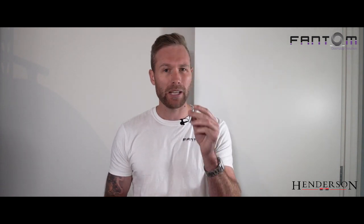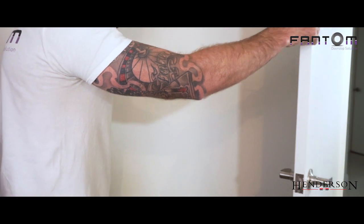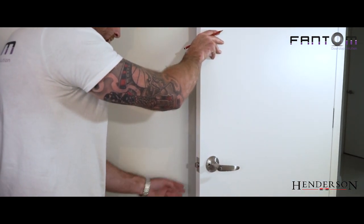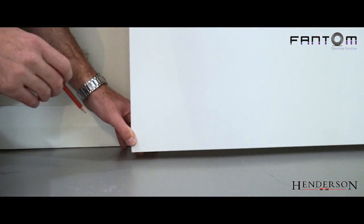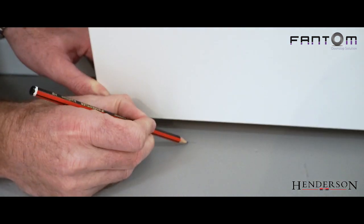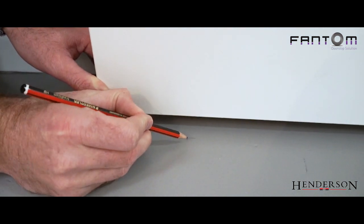The first thing you need to do is mark the pin location on the floor. Open the door up to its desired stopping location, allowing some clearance for door flex so as not to damage the wall. Lightly mark the floor along the door edge where you wish to locate the floor sleeve. Make a cross to accurately mark the centre of the hole to be drilled.